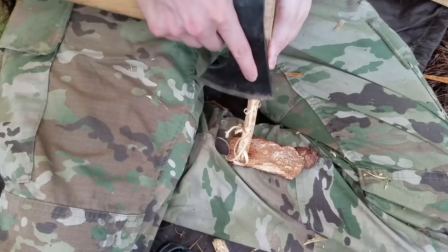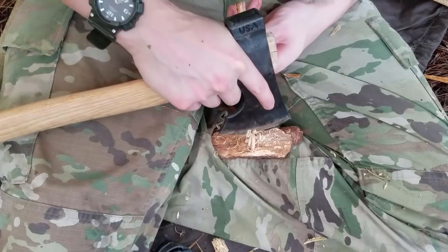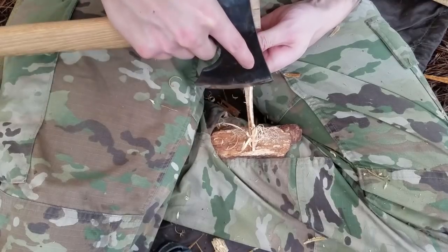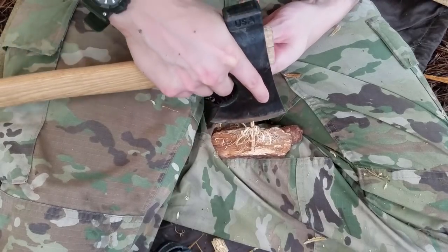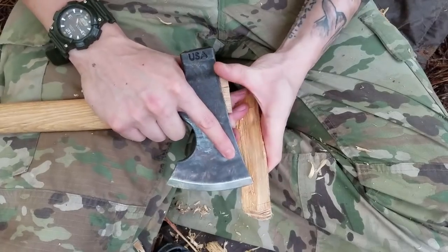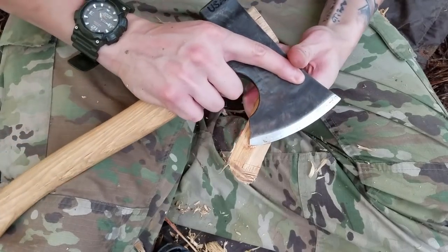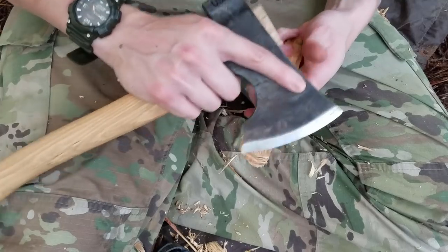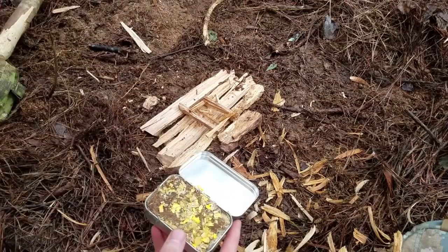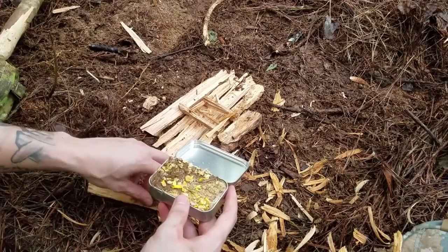The axe has a large size hatchet eye, so it's going to have stronger handles than your traditional smaller hatchet. It was kind of designed after riggers axes of North America as well as bearded axes of Northern Europe, as well as modified hatchets. In the past, a proper carving hatchet has kind of been a custom tool. A few companies have attempted making carving hatchets, but usually there's something wrong with them — whether it's the length of the beard, the shape of the handle, where the handle meets the pole of the axe, or the thickness of the edge. This axe is designed out of the box to be simply ready to carve.